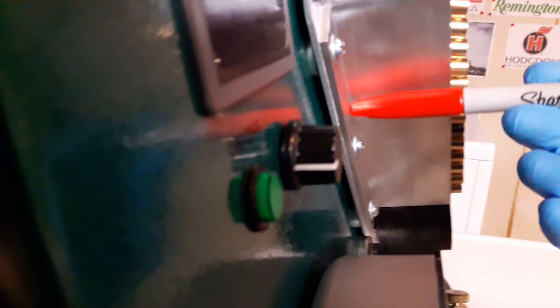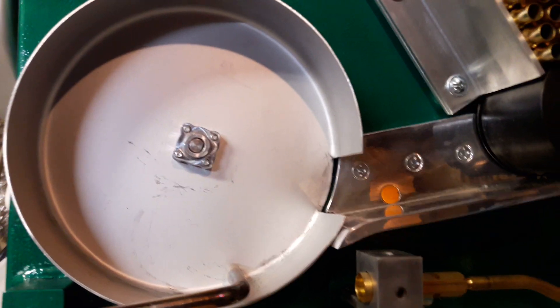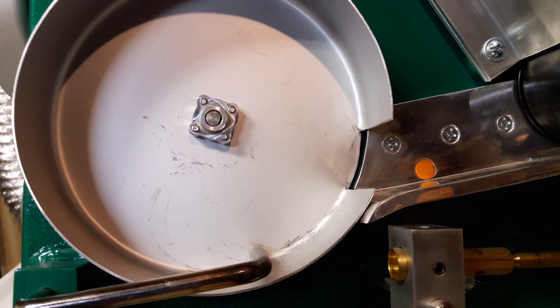People have asked about this hopper — it's not like the ones made out of wood. With this metal cabinet, I have the hopper spaced about 5/16ths off the main body. You can't mount it flush because of the annealing drum and the bolts that mount the motor. Also, these drums aren't the best since you're using a cake pan — you won't get great quality and they do have a little wobble. It's hard to find a good center because it varies around the circumference.